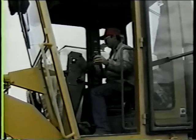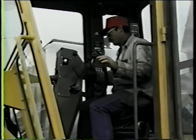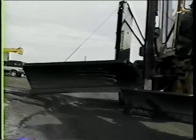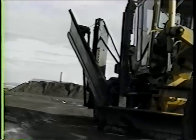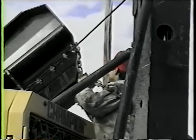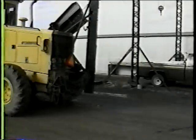Check the hoses for tightness. Start the grader and allow it to warm up. Move all the cylinders up and down just a few inches to make sure control cables and hoses are hooked up so that when the controls are moved, the correct action takes place. Move the front mast lift cylinder up and down, then move the rear mast lift cylinder and make sure it moves freely. Raise the wing two feet off the ground with the rear mast down and fold the wing up against the grader. Check to see that the wing does not fall past the center toward the grader. Check the counterbalance valve by articulating grader wing in the road position. Some models require that when articulating, the mold board be moved two or three feet away from the side of the grader. Most models have a safety chain with a double end clevis on the front mast sling ring. Make sure the clevis is tightly screwed to the mold board and has enough slack to allow for articulation.